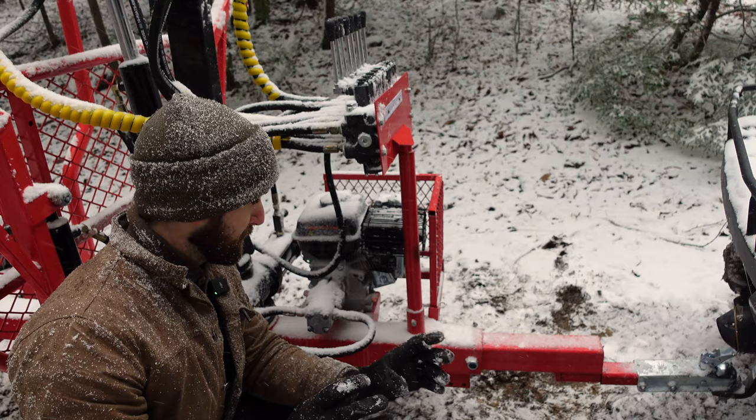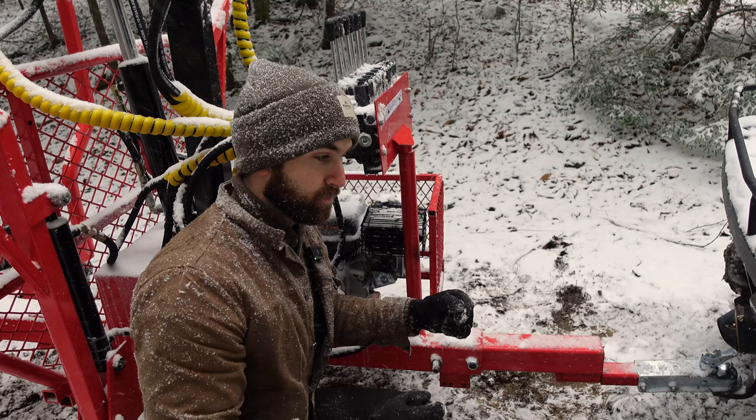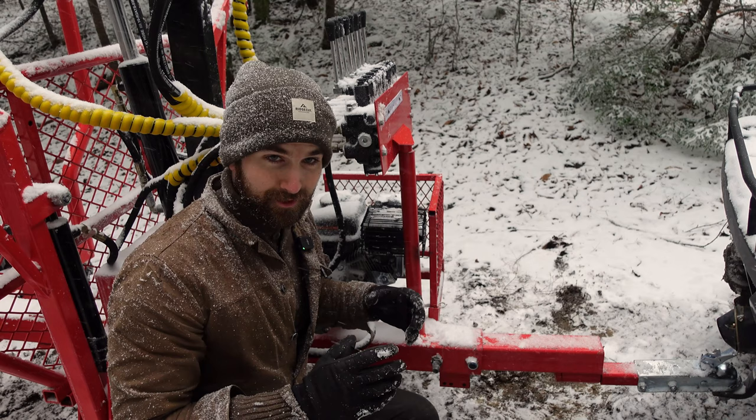Also, some of those Scandinavian systems actually have two cylinders on each side with a crossbar, so you can hydraulically pivot the trailer, which makes it more maneuverable and easy to back up and such. That makes it more mechanically similar to an actual forwarder, because that's how forwarders turn. It's hydraulically pivoted. So like I said, the Scandinavian models are infinitely more sophisticated.